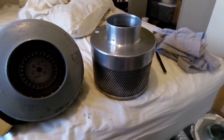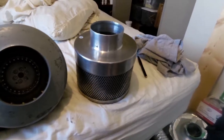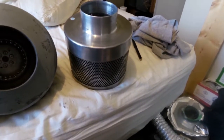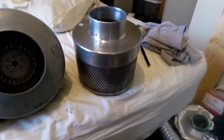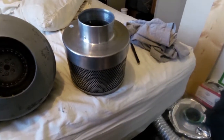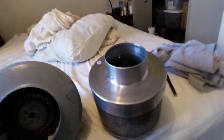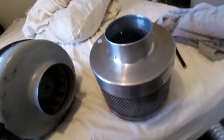What we're looking at here is an activated can carbon cartridge filter. These things are used to remove odors and VOC gases, and they work very well for that purpose. They remove odors that a HEPA filter just cannot, so it's a great supplement to a HEPA filter if you want to get rid of odors and gases. They come in different sizes — this is a 5-pounder; they come in 20-pounders, 30-pounders, just bigger canisters. All you simply do is attach your inline fan on top of it and pull the air through, and that will get rid of all of your odors for you.